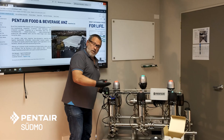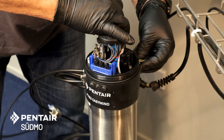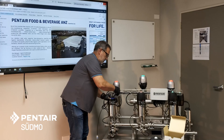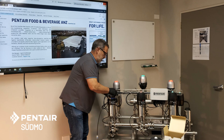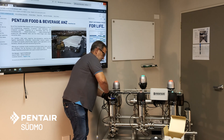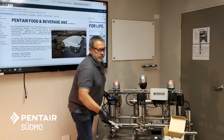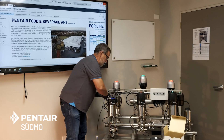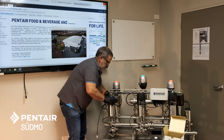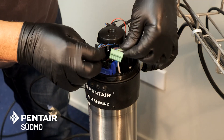Route this cable back through. Insert the cable connector through the PG-16 thread and refit the PG-16 adapter. Nip that down in place and refit the gland, then connect the power.